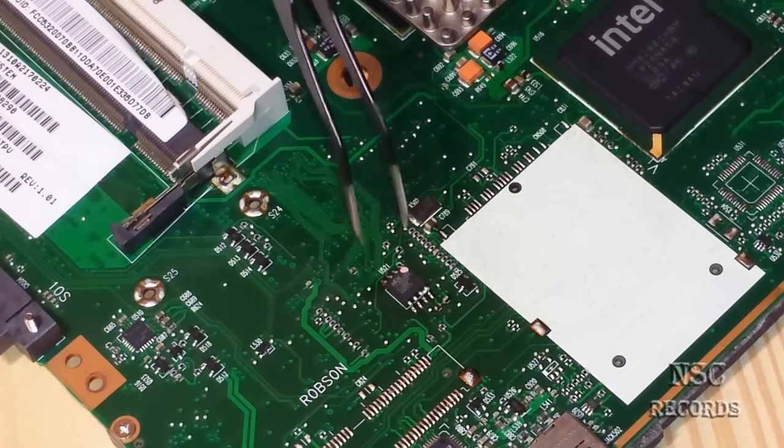Now clean your workplace and we're going to solder it back together - this is also very easy. Don't forget the position of the symbol. On this side you can also see a white line painted by the manufacturer so you know which side needs to be which way. If the contacts are placed wrong, the chip gets hot and will really be destroyed because it will have a short circuit.